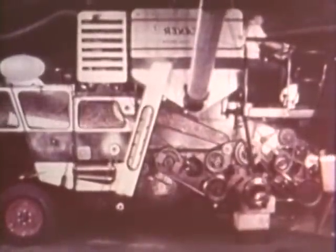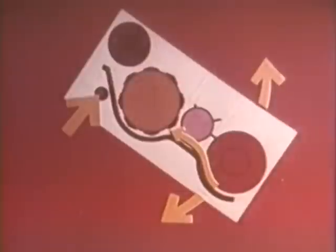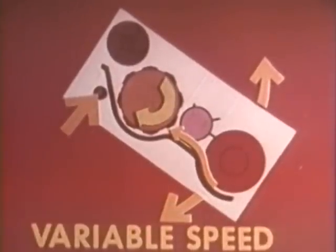You better show them how high-speed photography really lets you see that action. Down front, where it begins, with controlled feeding and threshing, and the cylinder moving at mile-a-minute speeds, the kernels seem to float from the edge. Also on Gleaner combines, the cylinder speed may be varied to obtain any desired threshing action. All of these features add up to control. And that's a power band drive on the cylinder. Strong, sure, and simple. And noiseless, too.